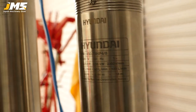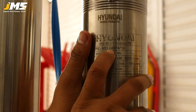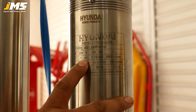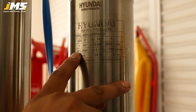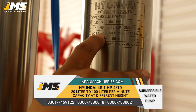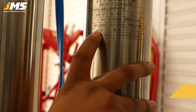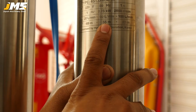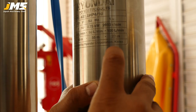The second model is 4S 1HP. This is single phase supply, 1 HP and 0.75 KW, same RPM but the impeller was changed. Here it is showing 20 liters per minute at the top, 60 liters per minute at mid-range. The head is 69 meters at maximum, and at 55 meters you begin to reduce the water flow.